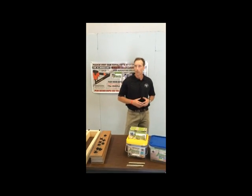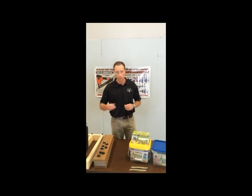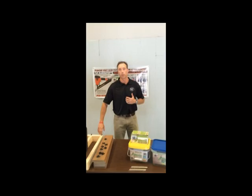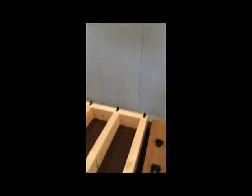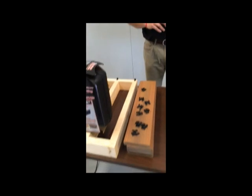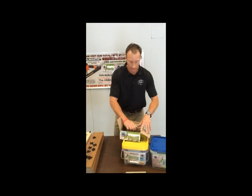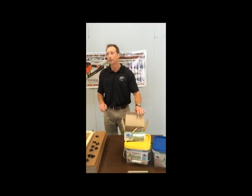When it comes to complete product offering, along with the clips that we use to put the boards to the joist, we have start clips, which are starter clips that are used at the ledger board, whereas it eliminates people having to screw down the first board. And then we have finish clips, which we'll show. They're an L clip that can be used at the end of the boards, again allowing screws to not be used, and I'll pull some of those out in a second.